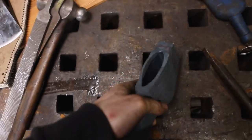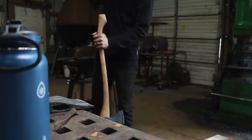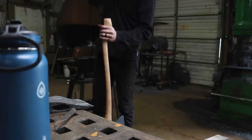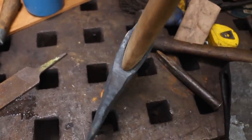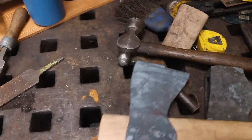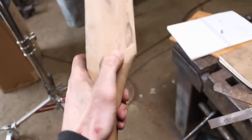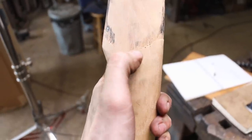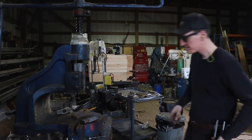Just finished forging up this axe. In itself it turned out really bad, but the eye is good, so we're going to see how that fits. That actually feels really good. You can see there's a little bit of wood chips coming off the side — I'm going to back it off and take a look. Martin says I'm downplaying this — he says it's perfect. I might just do a little bit more grinding. You can see there's a little bit of a gap right in the center where there's no fit, but that's close. Fine-tuning, right? We're going to try this drift out now — all tweaked up. This is exciting because this is the first Black Hawk axe from the train rail.